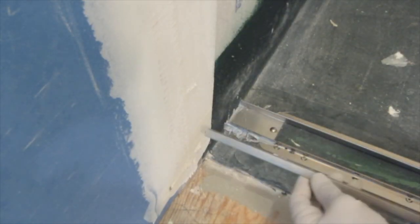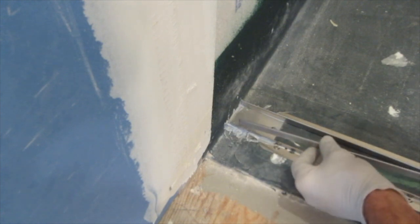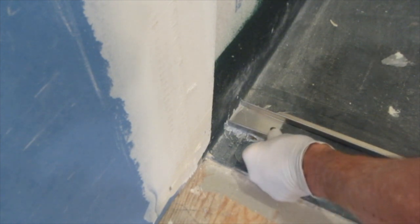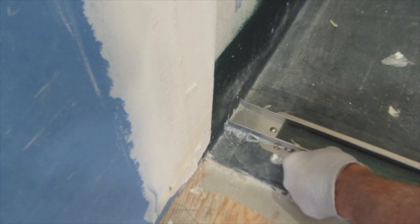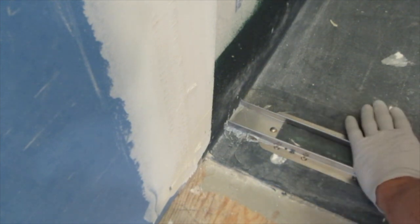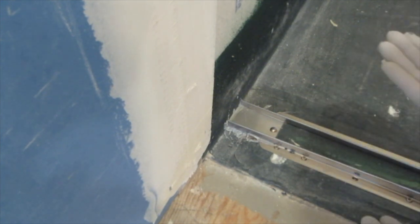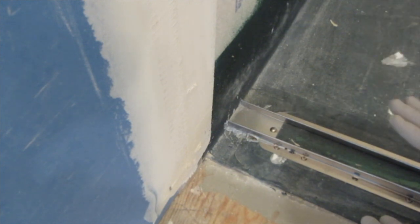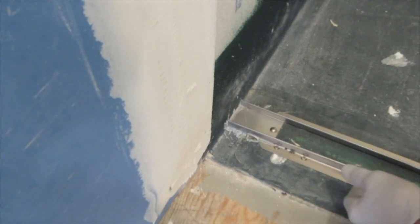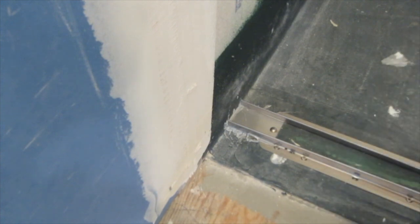The last piece is the moveable piece that goes on top here — this acts as where your tile is going to butt up to. You can get it started and just move it right along the clamping collar. What I like to do is leave it proud, set my tile, and then tap it down to its correct position to wherever your tile is going to be. Once this is installed and pushed down all the way, I'm ready for tile. If you do push it down too far, you can get a screwdriver underneath it to raise it back up again.